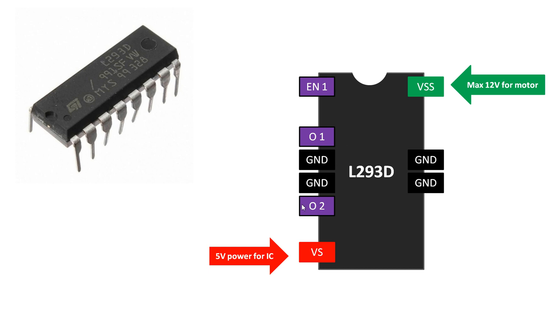It is not necessary that you always connect a motor — you can connect other things that require higher load, like LEDs. You have to give power to VSS. The maximum voltage the L293D can reliably hold is 12 volts. The datasheet says it can go up to 36 volts, but in reality the IC will blow up above 12 volts without proper heat sinks. Keep in mind the practical max limit is 12 volts without a heat sink.